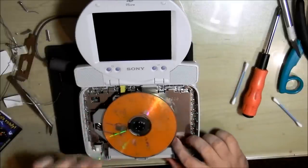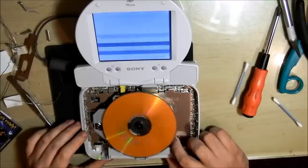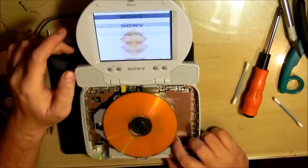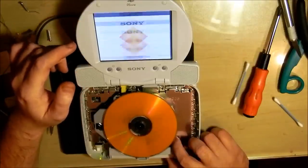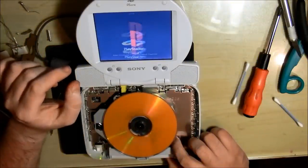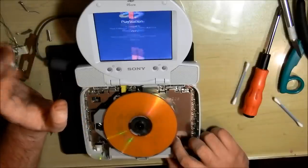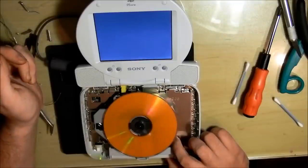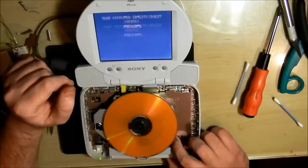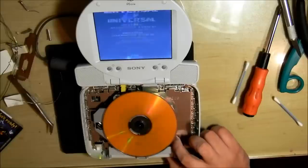Let's take the power in. That's normal. The OneChip patches the video signal in PAL, so the LCD doesn't have a way to react to the new video signal. It's designed to only accept a 100% PAL signal. If it sees a slight NTSC signal or any picture at 60 Hz, it freaks out. But if the game is PAL it should center. It's not a PAL game, but the chip's working — the stealth frame on the chip is working.